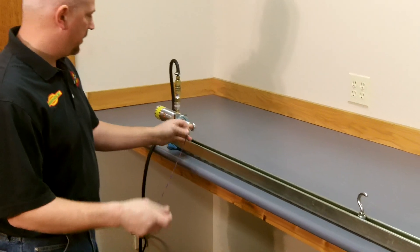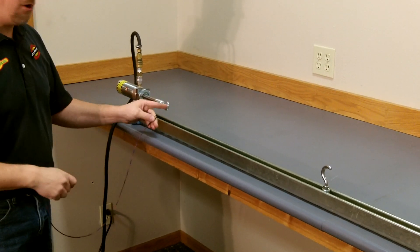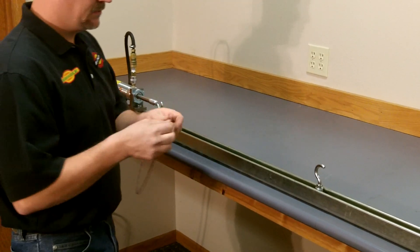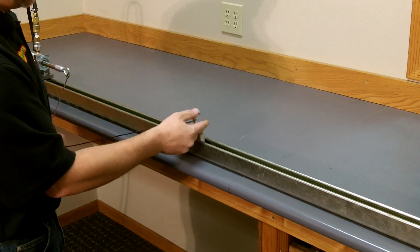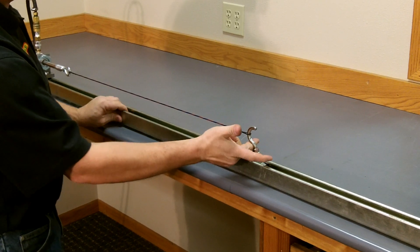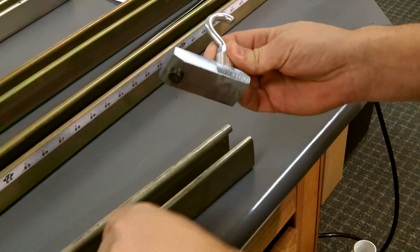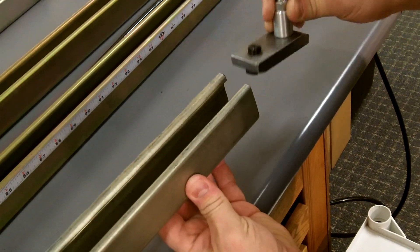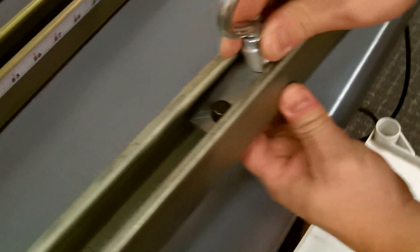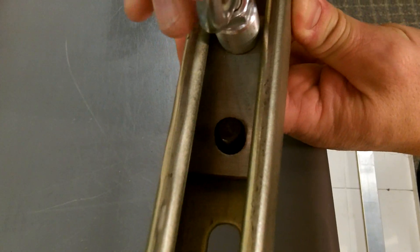To stretch our string, we have the valve in the off position and we simply slide this hook all the way forward until it stops. Put your string on — on the movable end, this will slide up and down the rail. Simply slide your other end of your string on there and slide it until it's taut. On our movable hook assembly, this peg will slip through the bottom holes on slotted unistrut, and that's what will hold it in place. As you tension your string, this will drop down into one of the slots in the unistrut and hold it there.